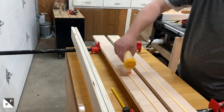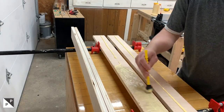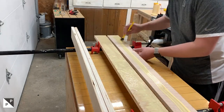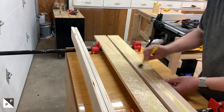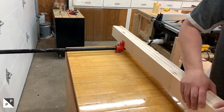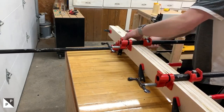After getting the fence pieces down to their rough size, it was time to laminate the two pieces together. I'm laying on a bead of glue, painting it on as nicely as I can, trying to cover every surface, then putting them together. I learned during this glue-up that I need more clamps — every woodworker has said that at least once. I also wish I'd seen Jonathan Katz-Moses' new crosscut video so I would have used a level during this step. He learned that from Tamar at 3x3 Custom.